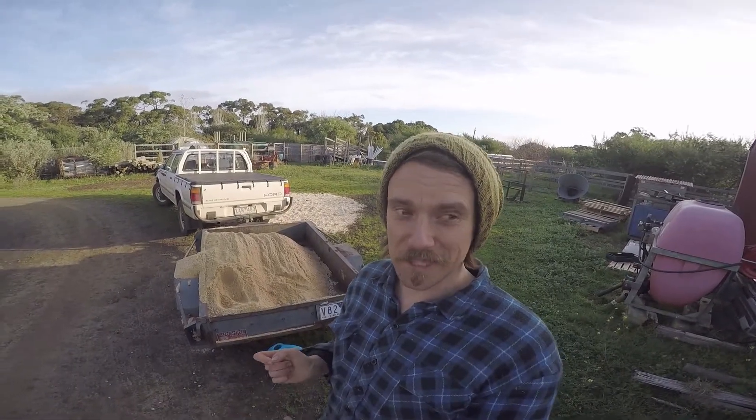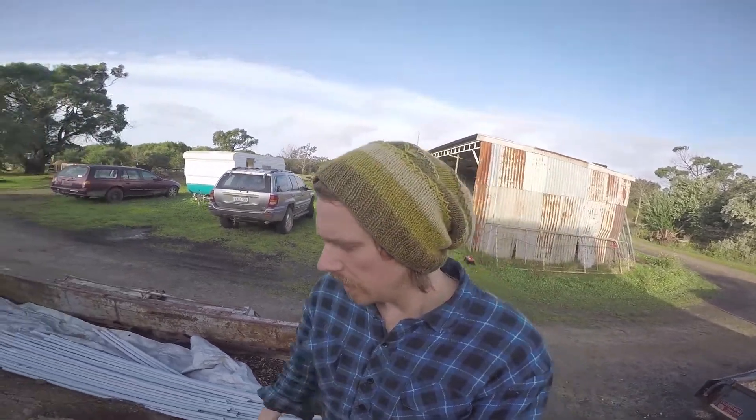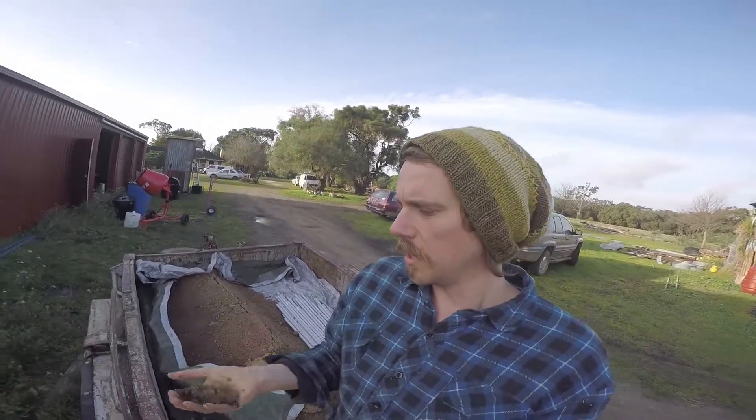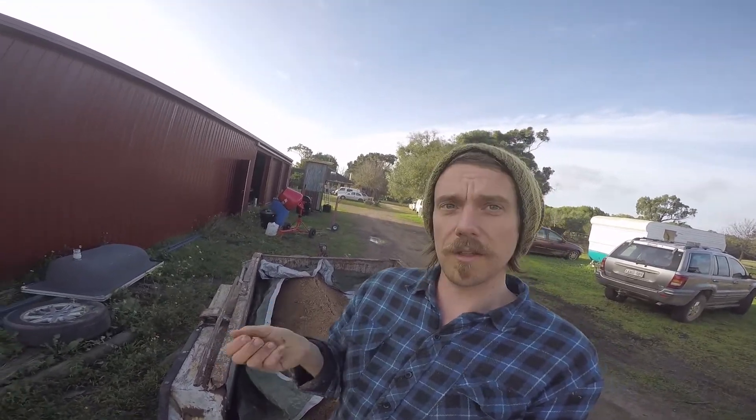Up to a really fun and interesting part where this gets into natural building, which is awesome. We're going to start doing the floor, hopefully start laying it tomorrow. We've got a really large pile of soil dug from another project. Because I can squeeze it together, throw it up and it stays together, it means there's at least some clay in there. On closer inspection — because I've been doing this for a long time — I know there's actually quite a bit in there. You can get it wet, roll it into a sausage, then try and bend it and see how much you can curve it before it starts to split. The more you can curve it, the more clay there is. I know there's at least 50% clay in here.